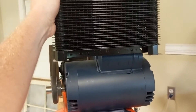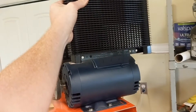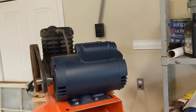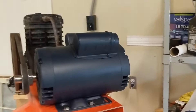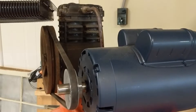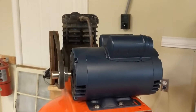This is going to sit up like that, maybe down like that, but it's going to be fairly high just to get a lot of airflow. I don't want the motor stopping a bunch, but any extra airflow, if it goes over to the compressor head, it'd be fine because the hottest part of the head is not cooled by its fan.